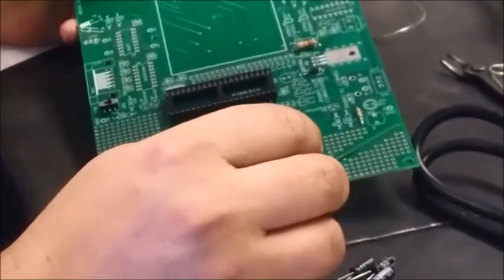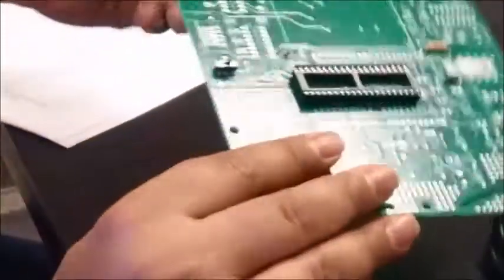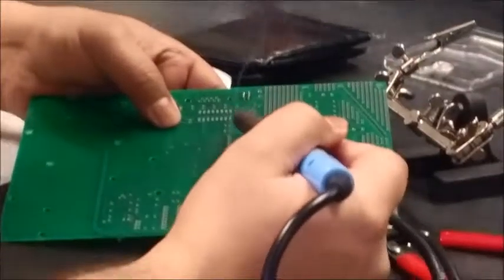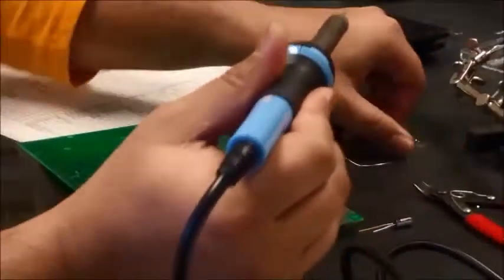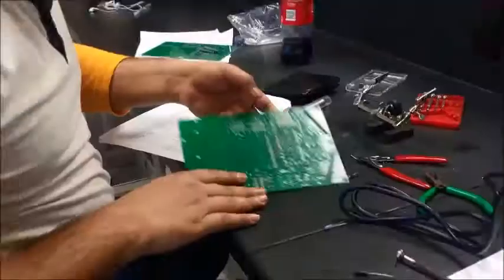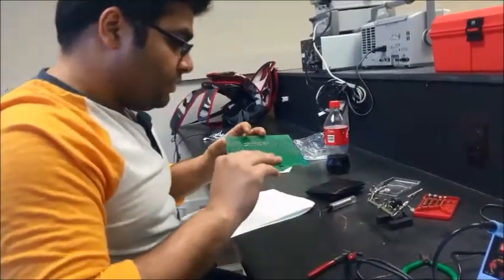Yeah. Right. So C1, looking here. C13, C1. Here, C1, C2. These are the C1 and C2. They go next to the oscillator that I'm gonna solder later, and it creates a phase lock loop there. It's used for that purpose. Capacitor and got that done.